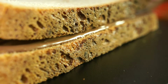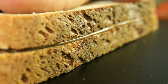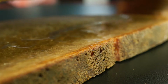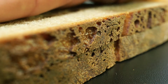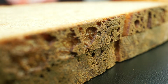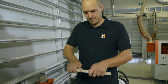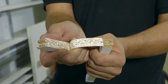When pressed, the possibilities for the high viscosity glue are limited. It can squeeze out above or below to form the joint. While, thanks to its 90-degree spreading operation, the low viscosity PUR glue can creep into the pores, creating an invisible joint. This high-strength joint is our major advantage.